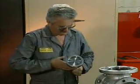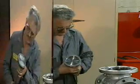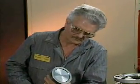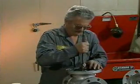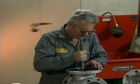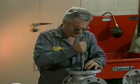The mechanic checks the disc-to-stem connection for proper movement by turning it manually. Then he inspects the disc for wear, damage, and corrosion. Minor wear or corrosion can be repaired by resurfacing or lapping the disc. In the event of cracks or excessive wear or damage, however, the disc should be replaced.